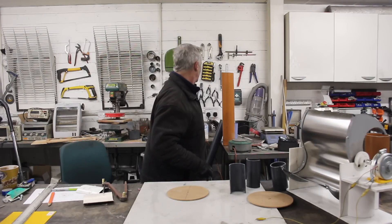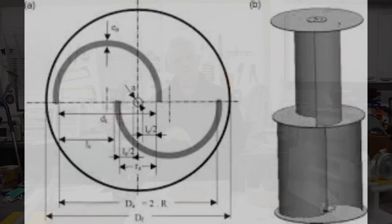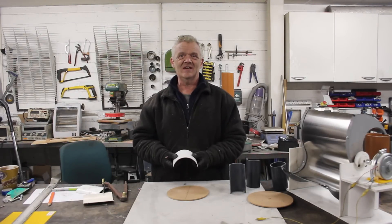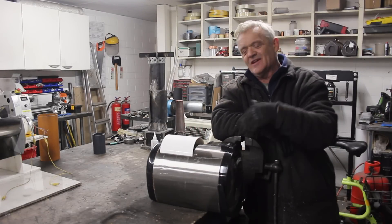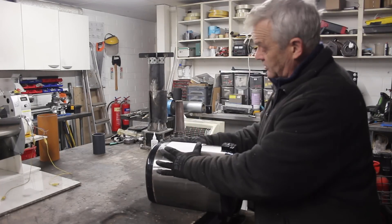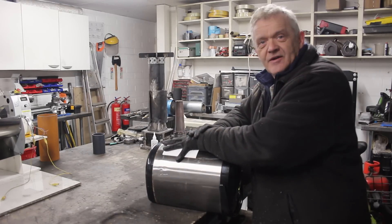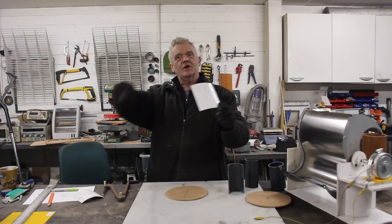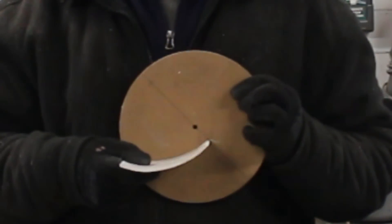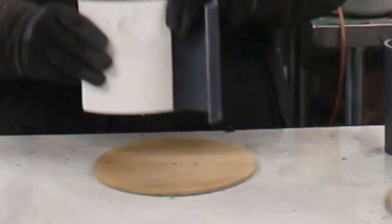I don't have a piece of 200mm pipe to hand, but what I do have is rainwater gutter that I cut into slices to make a Savonius. Once I've got it in slices, I can flatten it — this UPVC flattens really easily. It turns out my kettle is more or less the right diameter, which is great. A bit of stainless steel with the right curve — all I've got to do is put a bit of heat on it and press it against the kettle. It's surprising how little heat it takes to get this stuff floppy. Press it around your former, hold it till it cools, and you have your blade. These two bits together — if it had been a full pipe it would have been 200mm diameter, but because I cut this section off it fits on that arc I just drew, and that is the L section of the Ugrinsky.